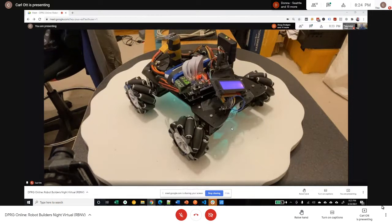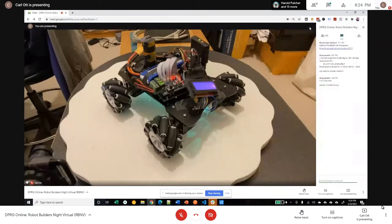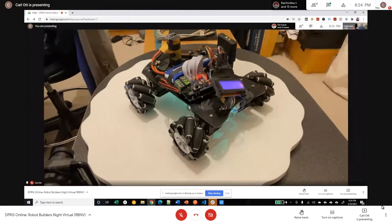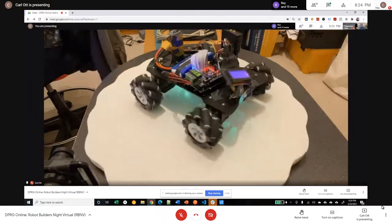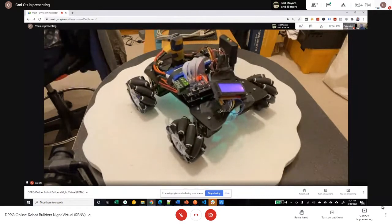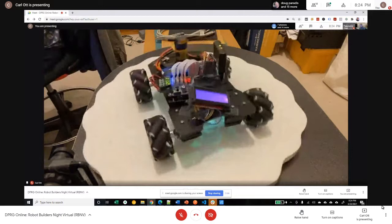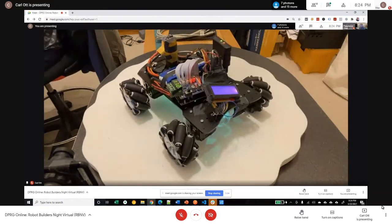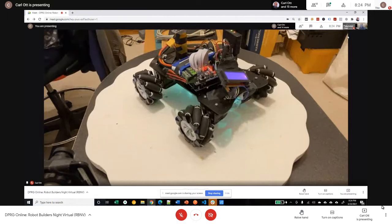Hey, Dave Eckley, you had a solution for that. Didn't you just add 360 and then your range of angles never goes below 360, right? I didn't ask for that. No. We were talking about the sensors on the wheel PID sensors. So a very different beast. It was an issue with math. If you added 360 to all your angles, you never had to worry about going below zero because you always had something greater than 360. And it was basically the same angle.